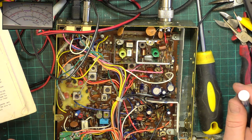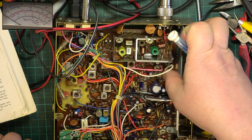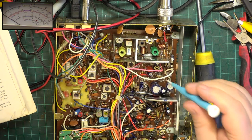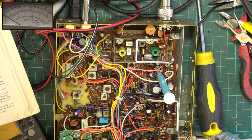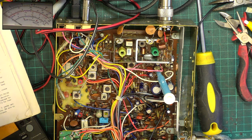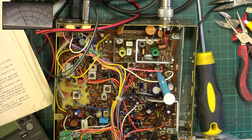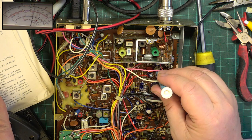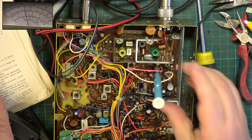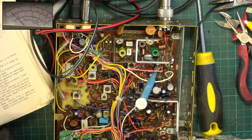Now, deviation. We need the mic gain one to kind of central position, which is the vertical one, and then deviation is there. So we'll get the little oscillator out. It's probably about right. Wallow. Oh, I'm on the wrong reading, that's why. Wallow, it's still too high. Let's try it there. Wallow. One, two, spot on. Guess that right.